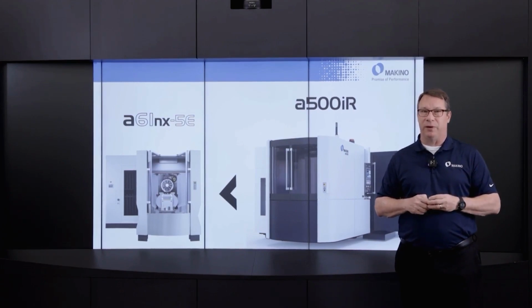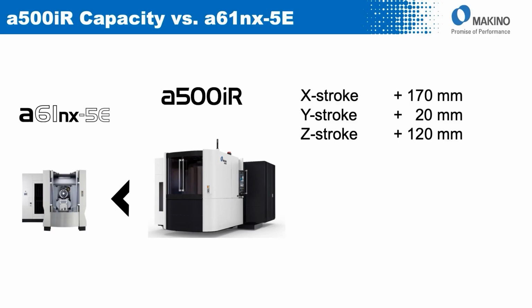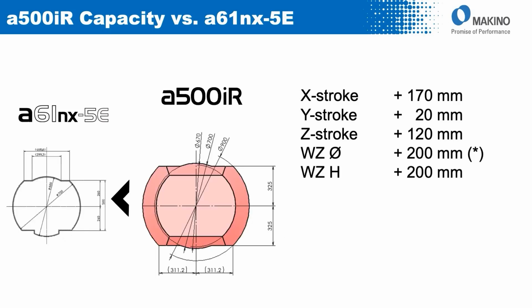So if we compare the two machines, the 500iR relative to the a61NX5E, X stroke goes up by 170 millimeters, Y by 20, and Z by 120 millimeters. The work zone is considerably bigger. If you look at the two pictures on the screen right now, they're scaled at the same perspective, significantly more payload capacity on the 500iR. And also from a weight standpoint, going from 150 kilogram with the 61NX5E to 400 kilogram, a very significant increase in that weight capacity.